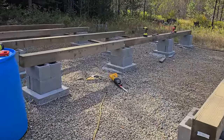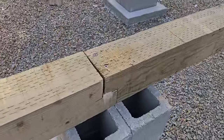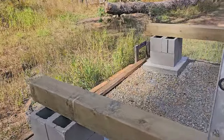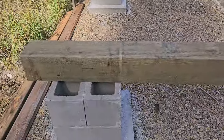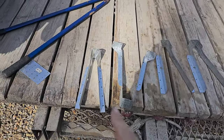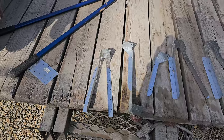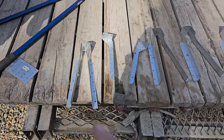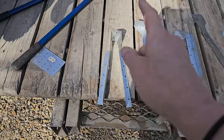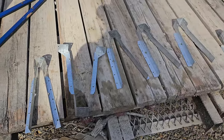All the beams are now put together and fitted. A couple required shims, but they are done. Now we're going to do some concrete. To anchor the beams to the piers, normally you use rebar, but we didn't have any. A neighbor brought a bunch of random stuff, so we're going to cut the tops off and sink one into each concrete pier, then nail it to the beam so they'll be anchored.